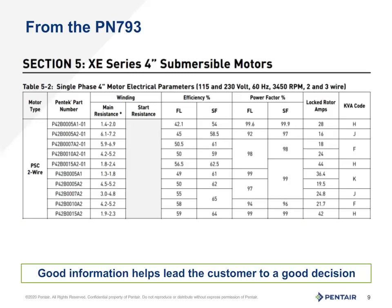Both would be bad, but they can indicate different issues. Low numbers often mean the insulation is in a weakened state — melted perhaps — meaning that current can flow easily through the system, potentially to the ground, causing an unsafe condition. So do check the ground integrity. Low numbers often also indicate a heat or motor running hot issue — this could have been a deadhead condition, poor cooling flow around the motor, or other issues. High numbers mean increased resistance in the windings. This could be a damaged wire, gaps, damaged insulation, or other issues, and is often due to an electrical surge or a voltage spike. If the reading is only a bit out of range, there is no magical formula or educated guess for how much time the motor has. Over or under is equally bad, but we have good information to give to the customer, and often this will lead the customer to make a good decision and replace the unit.